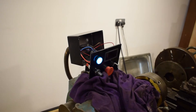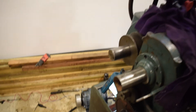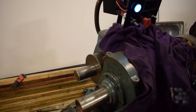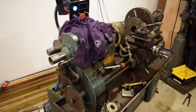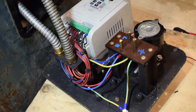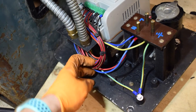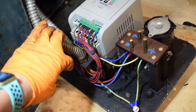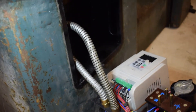So now all I need to do is put the covers back on, wire that RPM monitor in, and put the motor back in. I also have a new belt turning up, but that won't be until next week, but I want to just try and get it running today with the old belt if I can find something to repin it together. The wiring is all done, ready to go back together. Just to show how neatly I've got it all organised - I used my flush cutting cable tie cutter, put some cable ties around these bundles just to hold them all together neatly. Everything's done with ferrules. Looks great - so quite pleased with that. This can go in for the final time now, and then I can just wire the top bit up.